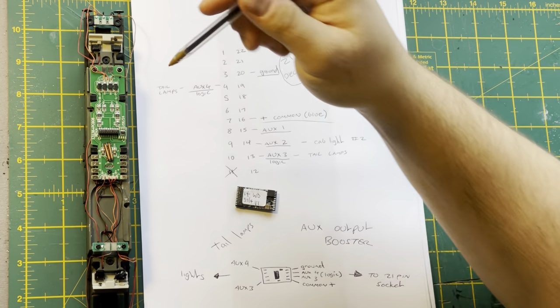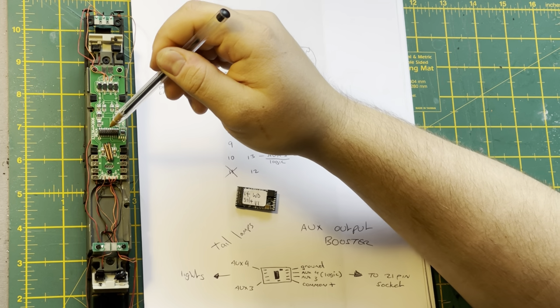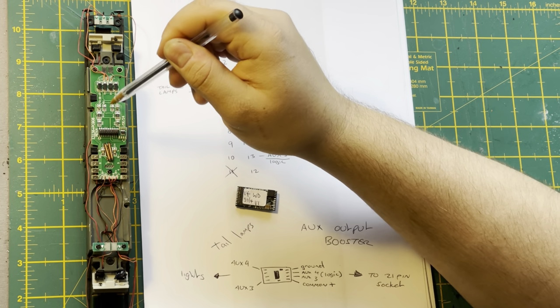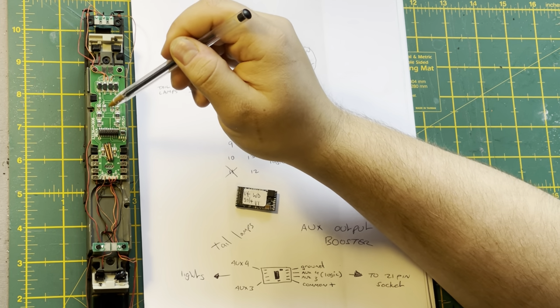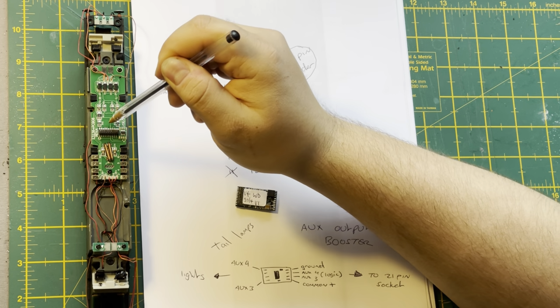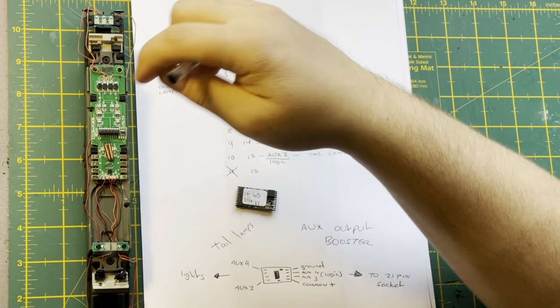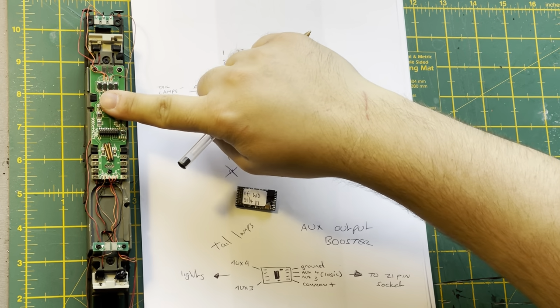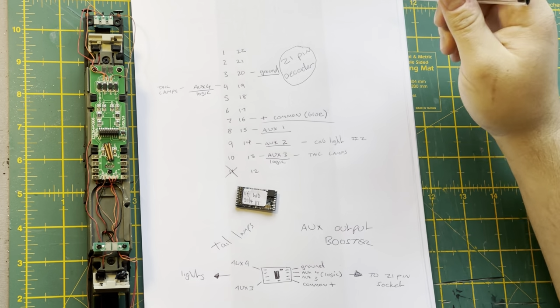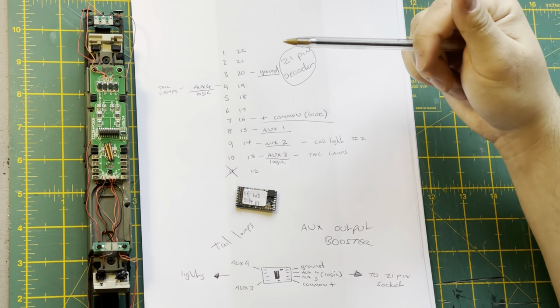And then once we've got the wires going onto the socket itself, I'll leave a bit of a loop just in case one ever breaks off and you need to shorten it a little and solder it back on. You should leave a little loop there in a U shape and put a bit of black electrical tape over from one side to the other. So just tape the chassis and then tape the wires tight to the PCB. That will keep them safe and stop you snagging them. That's the best way I've found to do it.